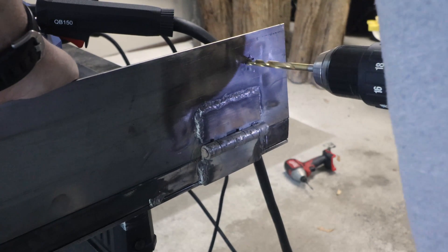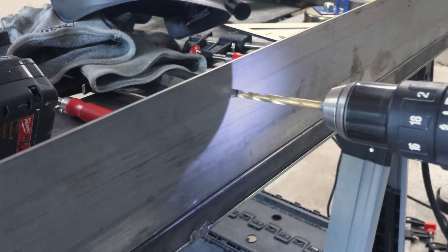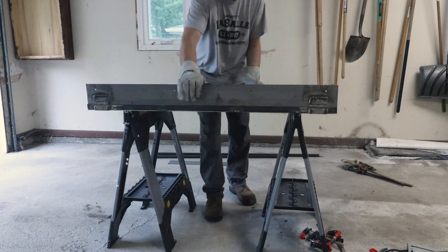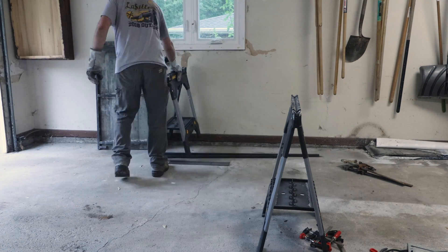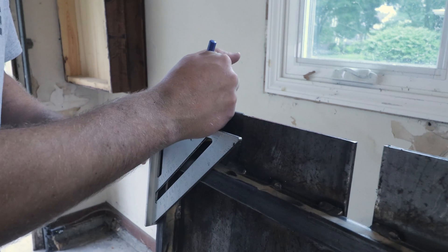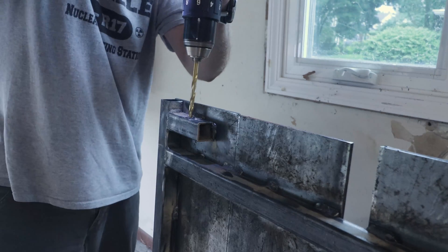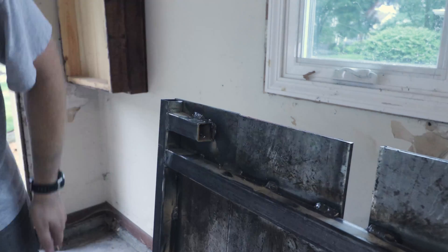The holes I'm now drilling are for mounting the table to the wall. I put holes at each of the studs at the hinge locations, and then two additional holes for the intermediate studs in between. It may not look it, but this table is pretty heavy — even without the legs it's about 75 pounds. Now for the step that is probably better done before assembly: drilling the pivot holes for the legs. As you'll see, I was fighting to keep the drill bit straight while applying the requisite pressure. A drill press would make pretty quick work of this.